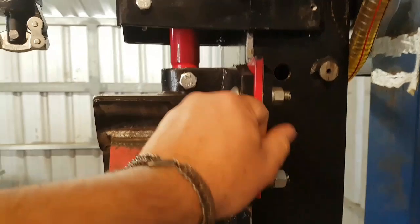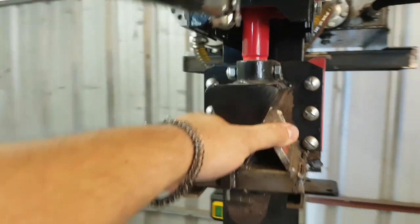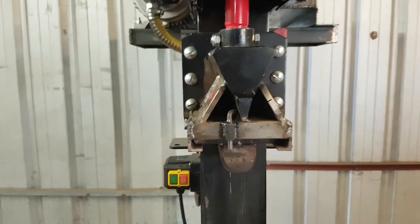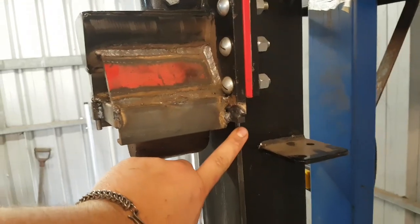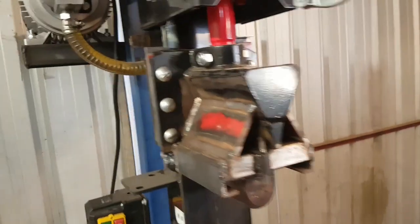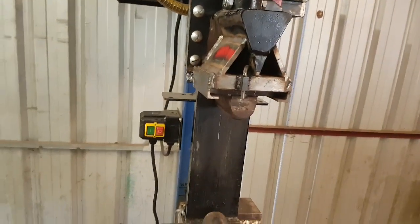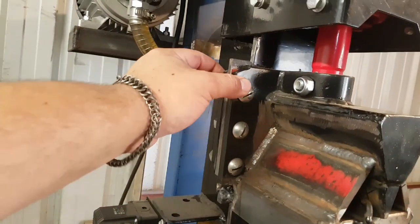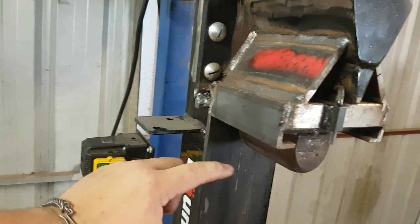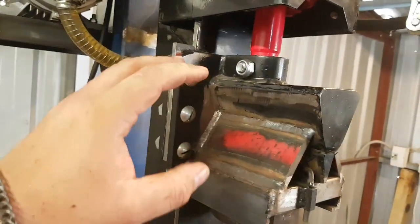The only other thing we did was make our own custom runners to true up the forward and backward movement. It doesn't rock side to side, though it does have a little bit of side play. The tighter you get metal-on-metal runners, the more likely you are to have galling and binding. When we first made the runners, we actually stripped about a 16th of an inch off each side because they galled up really quickly. Preferably you'd want bearing runners along here, and a longer runner — the longer your connection, the less likely you are to get slop. But with the plate already attached to the block splitter, this was the best setup we could get.